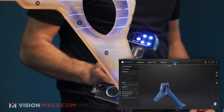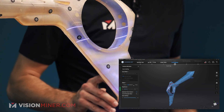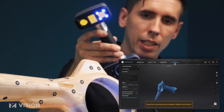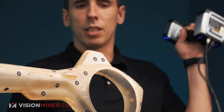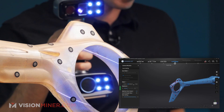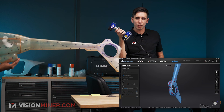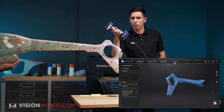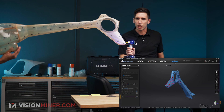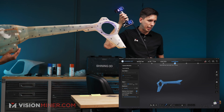Managing distance — always important. It's getting a little too close there, as you can tell by the data indicator on the left side of the screen. I'm going to get this top section a little bit more — looks like I'm still missing a little bit of data up there. So let me give it a spritz. I'm going to point it at the ceiling and spritz it. Now you can see it's lagging a little bit, probably because the spray was still on top of the markers there, so it's not getting as good of reflections off of it. For those of you that don't know, these markers are highly reflective — some people call them retro reflective. They're not just white dots; they are the kind of thing that you see in street signs, where it reflects straight back at you.